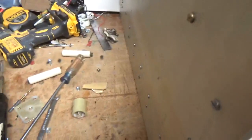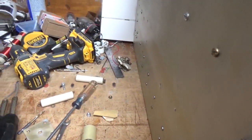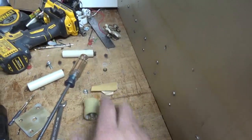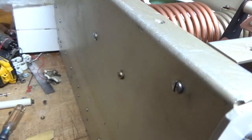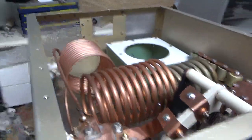Okay, so I'm back. I have the plate blocker assembly installed. That's why it pays to have a high-pot tester — one of them failed, it's right here. I had a couple of others on hand, so I had another one that was good and used that instead.